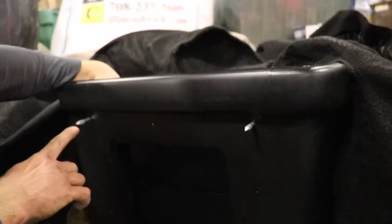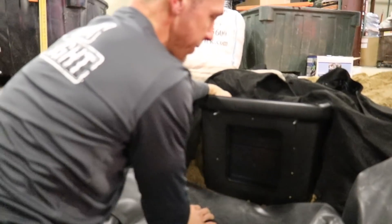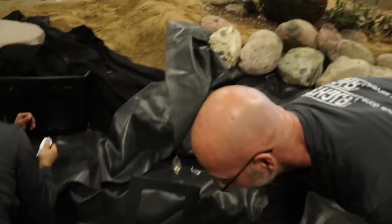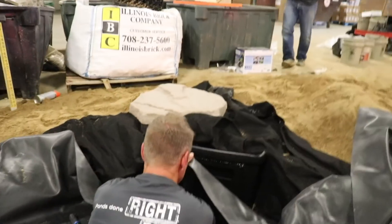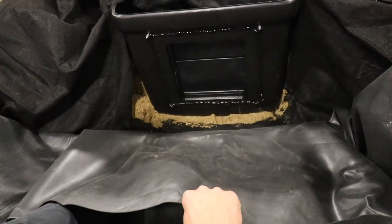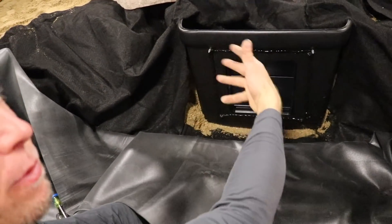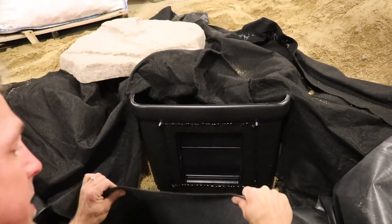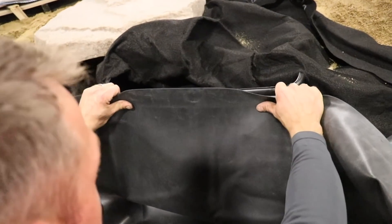Slide through the top two corners — hands free. The ends of the machine screws are machined to be almost like hole punches, so they will actually penetrate through the liner. I'm going to put a bead of silicone around the perimeter covering up all those holes, and that plate goes over the liner — so the liner goes up first. Keep this liner nice and smooth. It's always nice if you can give yourself a little slack — a four-inch fold of liner down below the skimmer — so if you ever have to reseal it, or if it shifts with freeze-thaw cycles in northern climates, it's easier post-installation to fix.